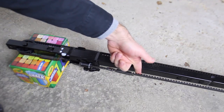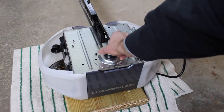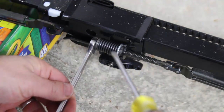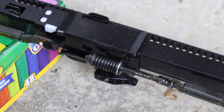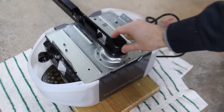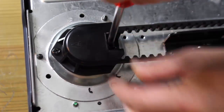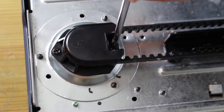Tighten that down and re-screw the spring back in place. Make sure it's finger tight so that you have space between your finger and the belt and the rail — just make sure the tension is nice and good. Then tighten it down even more using a wrench, and that'll make that spring pop by ¼ inch and tighten the belt exactly to the right tension. Put a cap over the drive on the garage door opener and tighten it down using the two screws that come with it. And you're on to the next step.